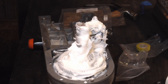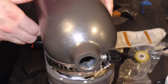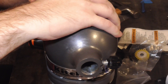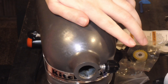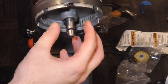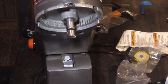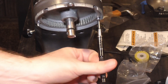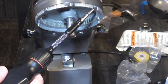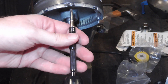Make sure you're happy with the amount of grease you've put on, then carefully put the housing back on top, coming straight down. The shaft should line up with the hole at the top. Make sure you don't pinch the wires on the motor in the back. Down here we're going to start by putting all the screws back in, and then more grease, because we need to grease up the lower piece since there are more gears at work in there. When putting these in, just start them until they're snug. If you want to do it like a car, use a star pattern to get your torque even on all of this — I really don't think it's necessary in this case, but I'm going to do it anyway.